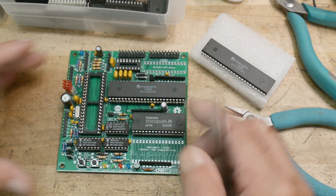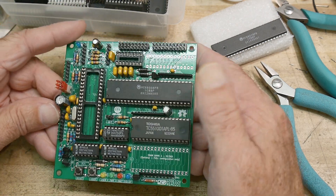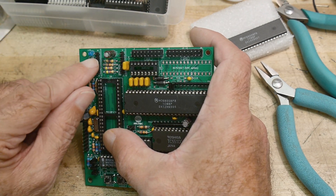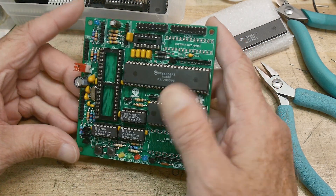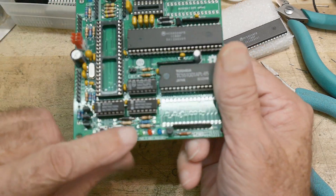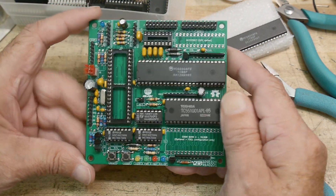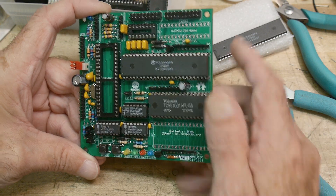Let me continue the build here. I think most of this project is going to be getting everything in software up and running — it seems to be well-documented. You need to program the PIC with some type of ISP, and then you need to put programs on the SD card. It has a lot of LEDs: user, power, halt, and I/O operation — I put different color LEDs. There's another LED for the SD card that lights up when you access it. The little chips are just an HCT11, an HCT00, and another HCT00.